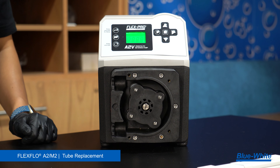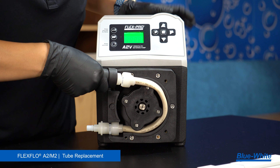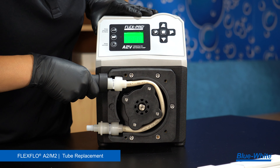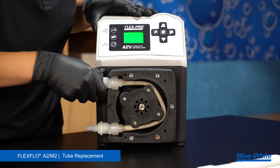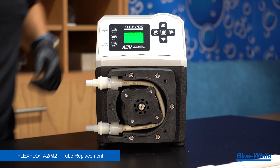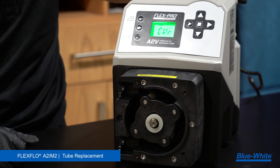Run the pump. Insert the tube adapter in the bottom slot of the pump head. Carefully follow the roller's motion while inserting the new tubing. Use the tube installation tool to assist with the tube assembly. Insert the tube adapter into the top slot of the pump head. If the front washer is separated from the pump head cover, reinstall it onto the shaft.